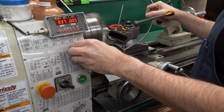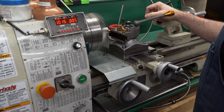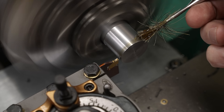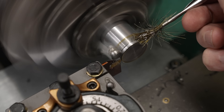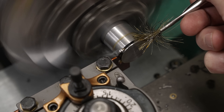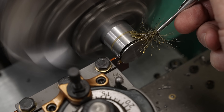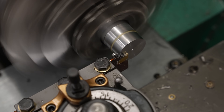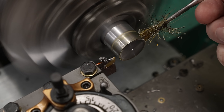It's going to chatter. It's going to grab. It's going to break. It's going to explode. I am wearing eye protection, however. The other thing you've all been telling me is do not stop — get in, start the cut, and just plow like heck. My heart's racing. Got my hand on the dial, and here we go. And that is probably the quietest parting cut I've ever heard. It starts to sound a little crunchy once we get to the center — some of that could be chips trying to exit, some of it the slower surface speed. I might not be doing myself any favors by slowing down in the middle. Let's take another cut and see if we can repeat that.